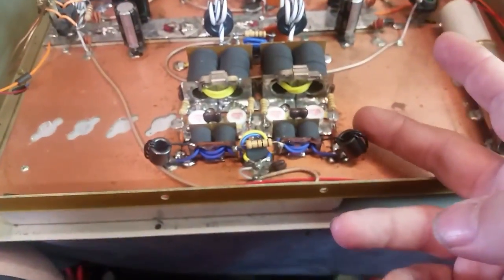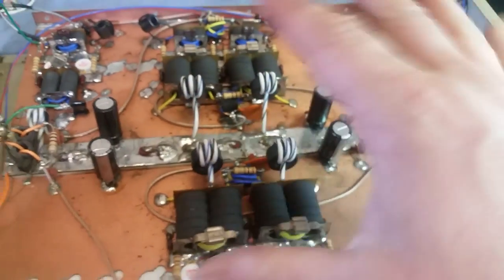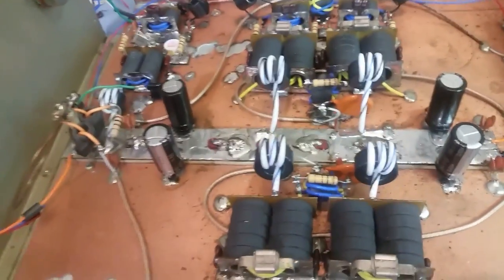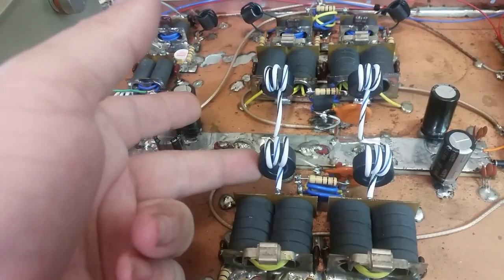And, of course, I think I already mentioned, there's no ferrite beads on the power wire up under the board that's feeding through the hot bus. So you have no inductance on that at all to help keep the RF off your power line, your distribution line here. So I went ahead. This is what was on there, some 61 core, which is default by Dave. And what I went ahead just to help a little bit with that is I got some big 43 cores here.